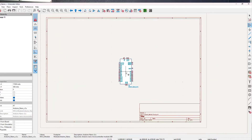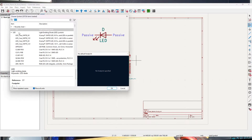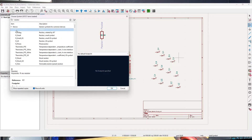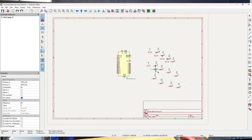If you can't find a component, chances are there's a link to the KiCad footprint or symbol available from the manufacturer. If they don't have one, it's not too hard to make from scratch, but that's enough material to be a whole different video. I'll drop in 12 LEDs — of which there are tons of types — and it doesn't matter a ton during the electrical schematic which you pick because it's super easy to change later.